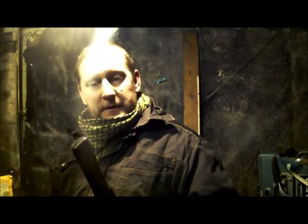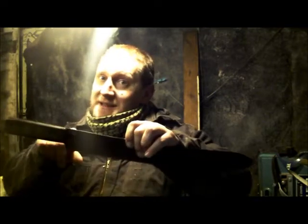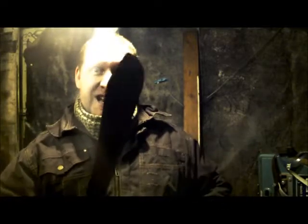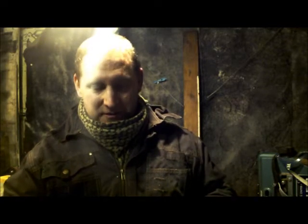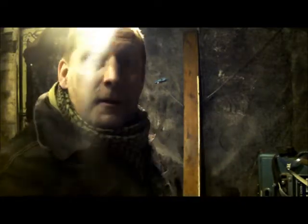There we go then. Let's see what's underneath, see how big the holes are, see what stock I've got, and how easy it is to drill, because of course the blade's tempered. Perhaps the handle hasn't even been hardened, so it'll be nice and easy to drill. With these recons you never know till you get there. It's not like working in O1 and old bar stock to start with, flat stock. I just don't know how hard it is underneath. So, get my bandsaw up and running. I'll see you in a minute.